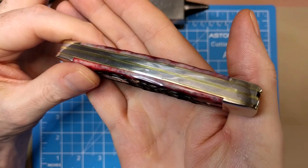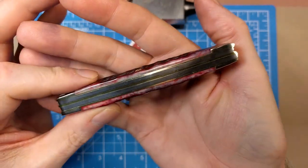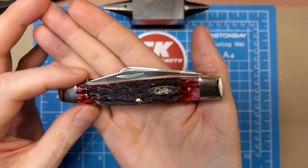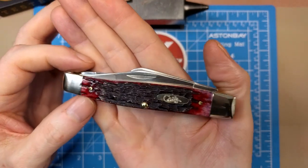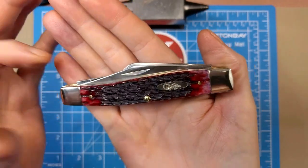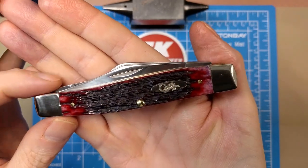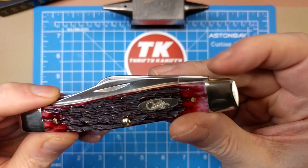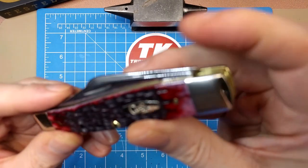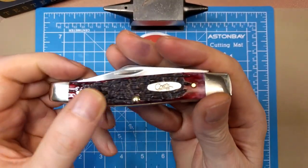Looking at the back, we've got brass liners on those mirror-finished stainless springs. Not really seeing any gaps, so I'm pretty happy with the build. Fit and finish seems pretty good. I will say there's going to be some blade rub on this one — I feel like all the Case stockmans have a little bit of trouble with that. The tight blades are kind of tight together, a little push rub, but all the blades do sit flush into the channel. The elbows are pretty tucked in, nothing round or proud enough to catch or cut you. The tangs feel finished well with a nice rounded edge, so nothing's poking at you.